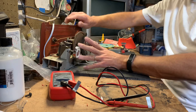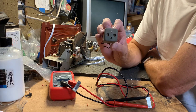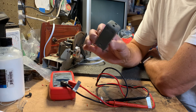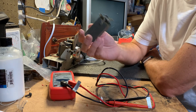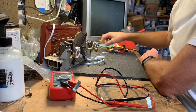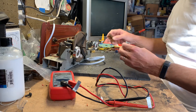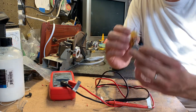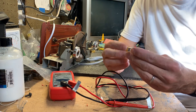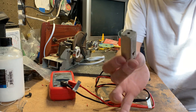This is what the old IF cans look like. Until the late 40s — around 1949 — these are much better in older radios. They went to these little guys around 49 or so, and they look like that. And they're notorious for going bad.